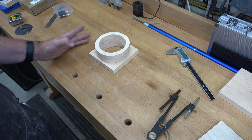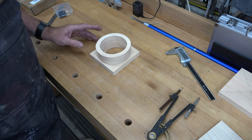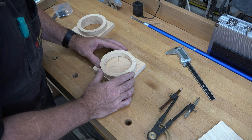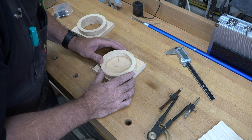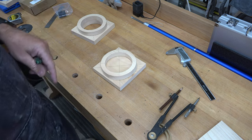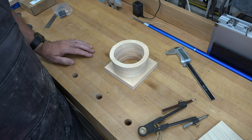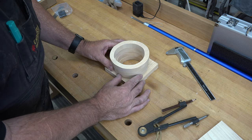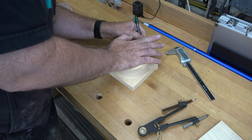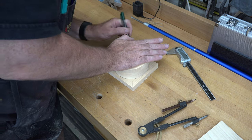None of the rings are cut perfectly, none of them align perfectly — and that's okay, we'll fix that later. We want to add one more ring, so it's the exact same process: take our top ring, take another five-by-five blank, trace the larger diameter surfaces onto stock, cut at five degrees on the scroll saw. There's our third ring. I'm going to line up the rings as best I can and mark the base so we know where to cut a little later.